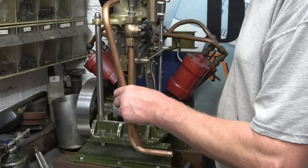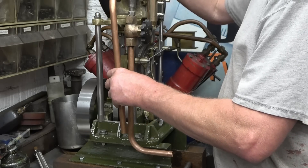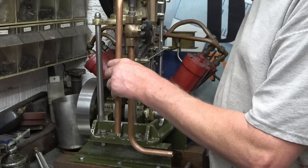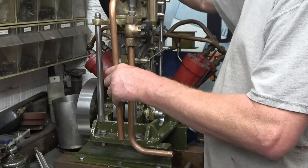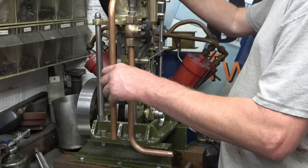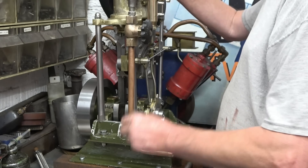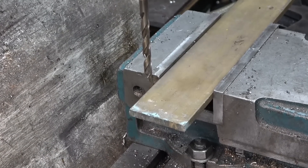So the next stage is to make a new little flange - a piece of bronze or a piece of brass - and then we can solder that in. I could even make a union and screw it in, but I think to solder that in will be quite sufficient. I might even be able to use the original one that's on there and just drill it out. I prefer this heavy wall stuff to the plumber's copper pipe, the house copper pipe, which is really thin wall - it's just no comparison. I'm going to make a new flange for the exhaust port on that steam engine.